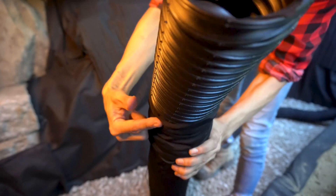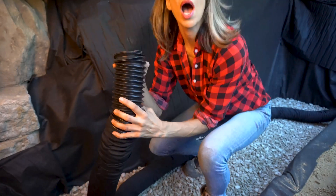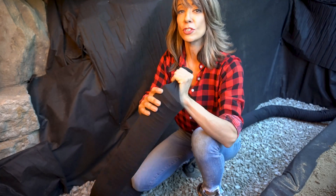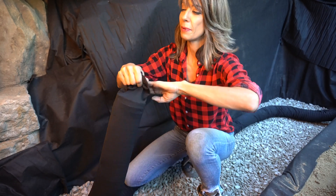This right here is our drain line that we are gonna be installing. It is a perforated pipe — that just means there are holes on the bottom. We have water coming up from the bottom from our water table and from the top. This is the sock — we call it a sock. It's filter fabric designed to keep soil out. Have you ever seen a retaining wall that tips forward? That is because of hydrostatic pressure. Hydrostatic means water that doesn't move. When you have water that doesn't move behind a retaining wall, it's gonna push it forward — very bad, very common. This is absolutely critical.